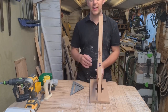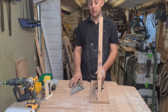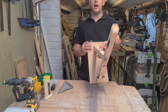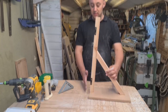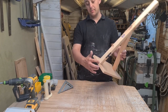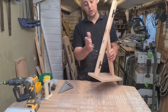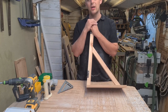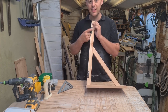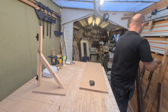For the clips, I've used these lift-off clips — I'll put a link in the description if anybody's interested, they are pretty smart. Simple but handy little clips. Everything's cut on five degrees — five degrees the bottom, timbers cut at five degrees. These are all mitered, glued, bradded, and screwed. I'll crack on and get these made, and then I'll get a panel in and show you exactly how to fit these clips.